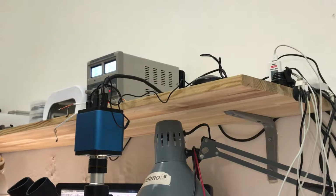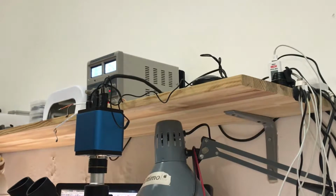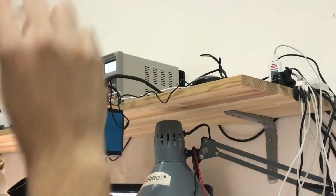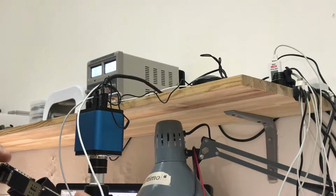Now that our work is done, we will connect the board to the power supply to see if the short is gone and our work is okay. And yes, I didn't solder the audio amplifier back because I want to check if the phone works first, so I can take the information out of it. Let's check. I connected the screen also to see if there's an Apple logo.